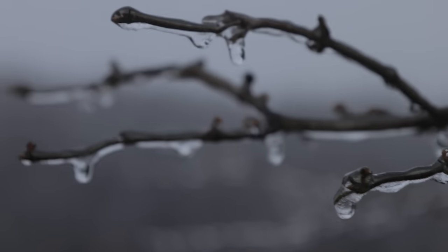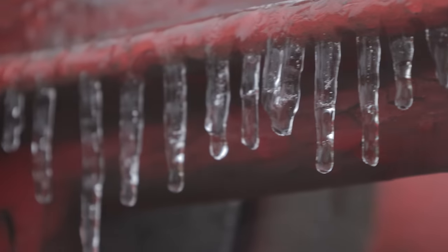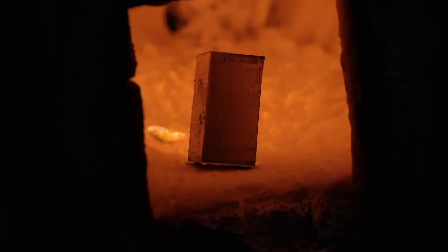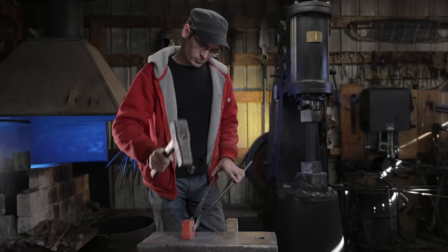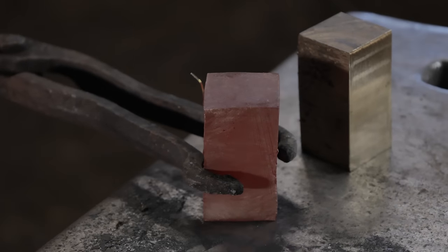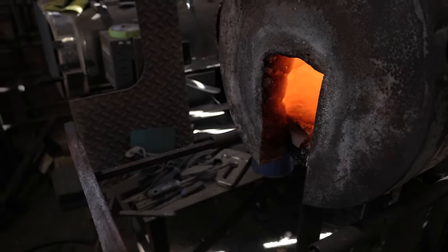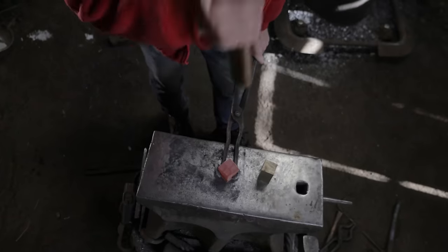Because in our case, the sword is so massive in terms of the amount of mass and where the stress points are, it is actually fairly inappropriate to use the traditional tsuka or handle construction that you will find on katanas. One of the number one reasons is that we need a counterbalance to such a massive blade. So instead of doing the very standard and traditional fuchi and kashira setup, I'm going to use forgeable bronze and start making them as if I'm making them for a Western kitchen knife or a Bowie knife.